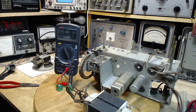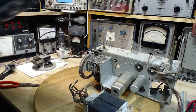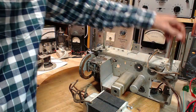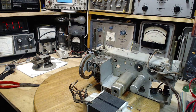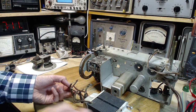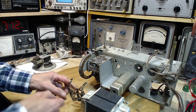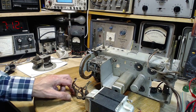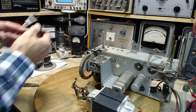That's pretty close to a thousand, isn't it? The way to test this is really to energize it — this is really the way to test it. Doing resistance measurements, I'm going to be guessing. Even if I get measurements that indicate problems, I'll still be making assumptions about whether I'm doing the test properly. I think it's much better to apply power to this. Since I don't hear anybody arguing with me, I'm going to go ahead and do that. Luckily, I have a way of doing this that's safer — I'm not just plugging this straight into the wall.